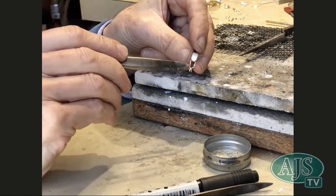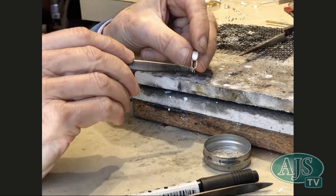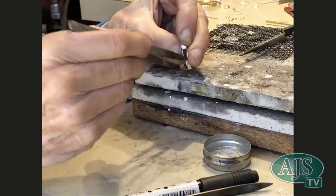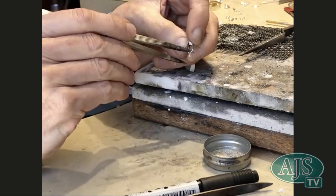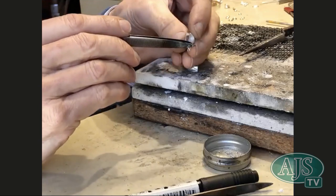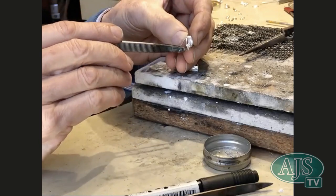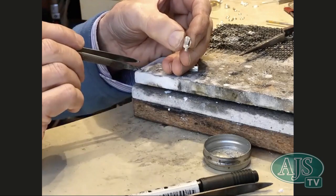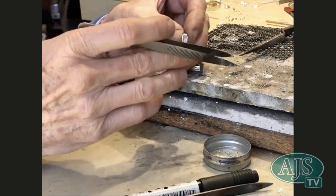They look so simple. So I've now got my wire. There are two little ends there. I'll just pull them apart a bit with the pliers, with the tweezers. So they are not joined, but they sort of swing around. They go over the bead. If I pop that down, they swing around the bead, and there's a little extension on the end there, which I have to solder closed before I start adjusting the tension, the mechanism on that.